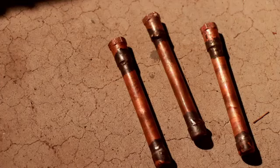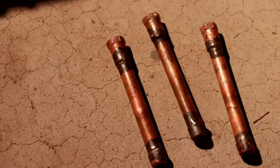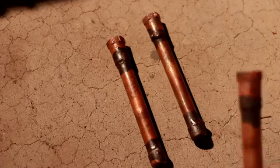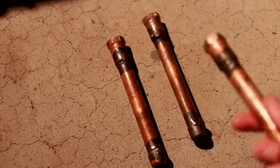So keep in mind there are hazards involved. You can be burned, the open flame can present a fire hazard, and if you do this in an indoor or confined space, there's a risk of asphyxiation or carbon monoxide poisoning. So ensure that you have adequate ventilation and that you use the necessary precautions to ensure that you aren't injured or don't cause any property damage while working on whatever you're using this brazing technique to do. And like I said, I'm not an expert, so I'm not responsible if you destroy your air conditioner or whatever else you might be brazing due to a faulty braze joint. I also wanted to mention, you want to use an inert gas if this is going to be used on any sort of closed-loop system or anywhere that contaminants from the oxides that can form inside the pipe would be an issue.